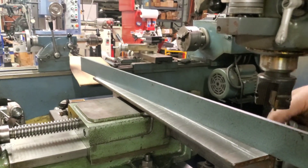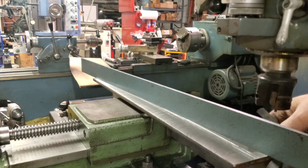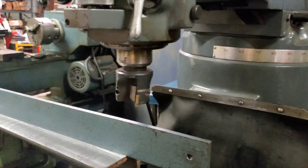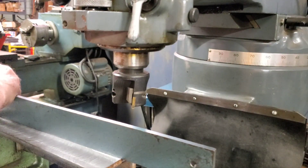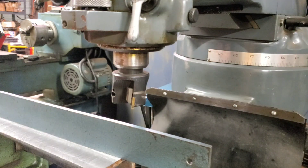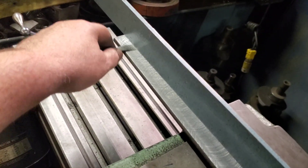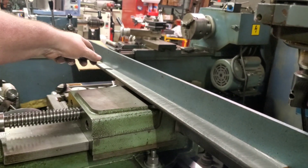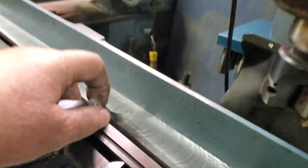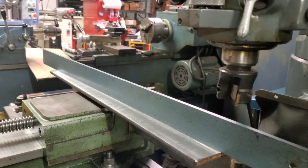I've got it straight within about 2 thousandths. I've got a feeler gauge here — let me lift my straight edge up. Considering I don't have it fully supported — I could have put some jacks under it, might get a little harmonic — but 2 thousandths right there, all through the middle. I can just see 2 thousandths trying to start right there. I'm fine with that. Let's get it turned over to the other side.